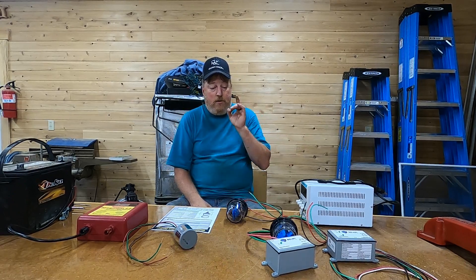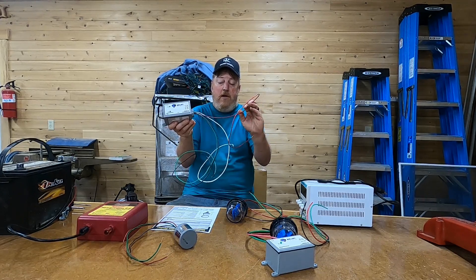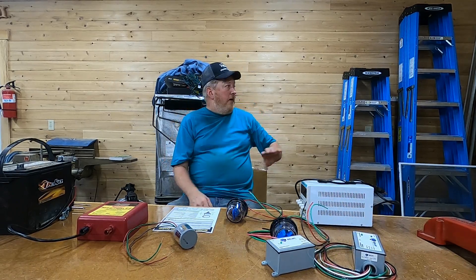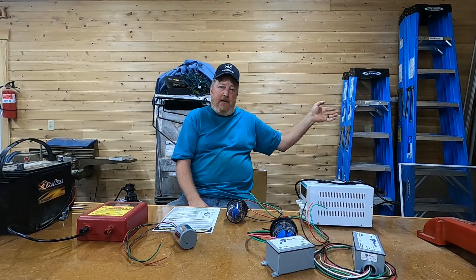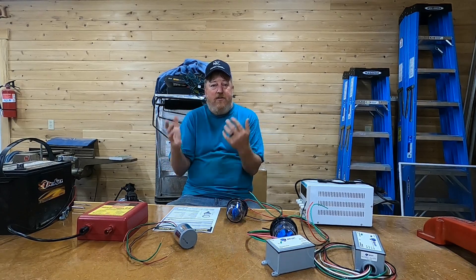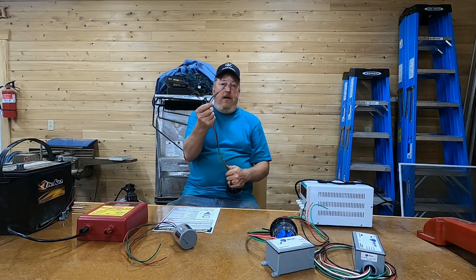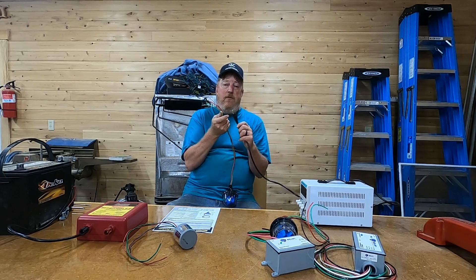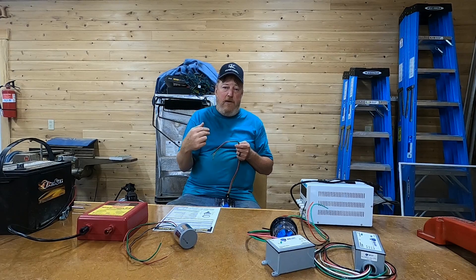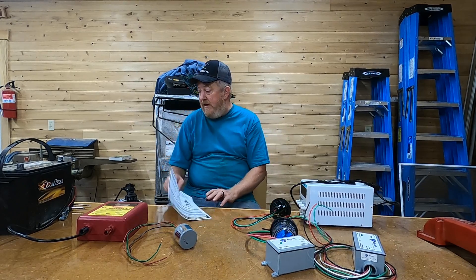One kudos I'll give the EMP Shield — and we're going to find out if it's really kudos — their AC surge arrestor has an L1 for hot leg one, an L2 for hot leg two, and a neutral. One of the things I've stressed a lot is that you need to protect the neutral. That breaker panel over there is a sub panel out here in the shop with about a hundred feet of wire feeding it. That neutral in that breaker panel basically acts as a separate conductor when there's a bad surge, because of the resistance in the wire back to the neutral-ground bond. So if I put just one Midnight on there, I've done L1, L2, and ground — but I've ignored my neutral. And if we take a really bad lightning strike, that neutral out here will rise way up in voltage, creating a delta between the neutral and hot, and burning equipment up. So you really want to protect the neutral in a sub panel.